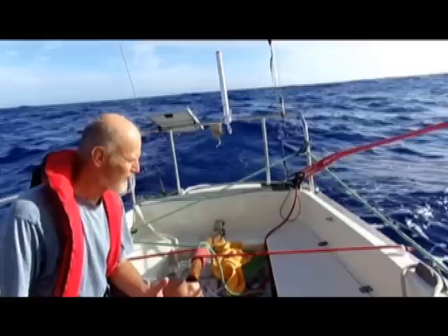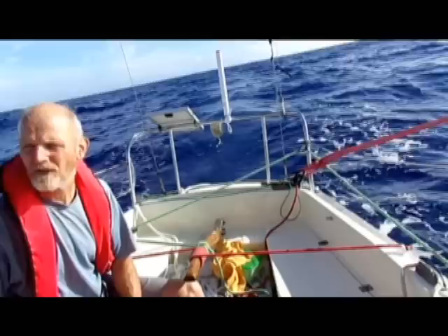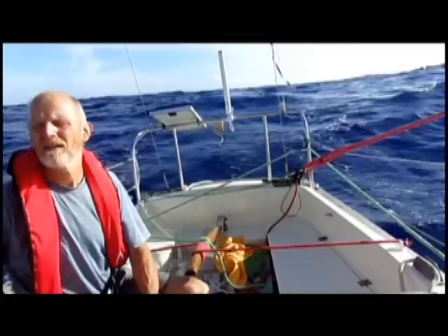It's very stable. If you get an increase in wind strength, unlike going to windward, this can cope with quite an increase in wind as well. It might be a slightly different course relative to the wind, but it's not going to go off — it's so powerful. And this rig works with a treble-reefed main and storm jib if there's enough wind to warrant that, and it copes with all the waves that are about in those sort of conditions.